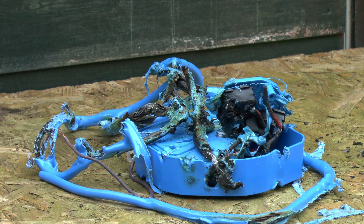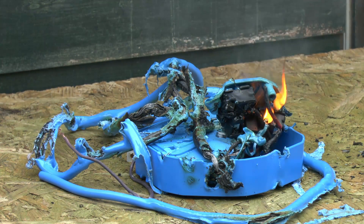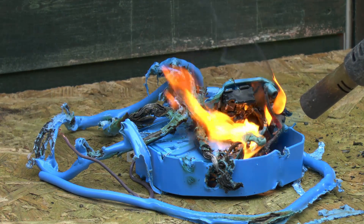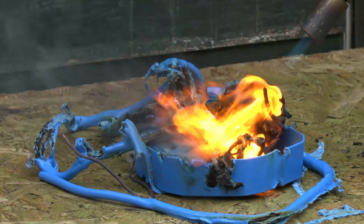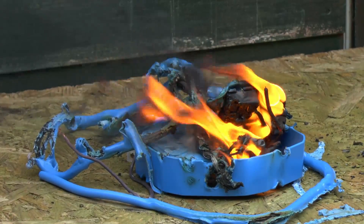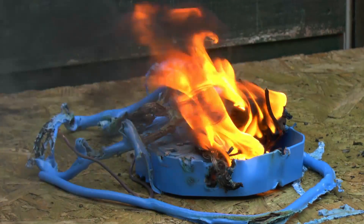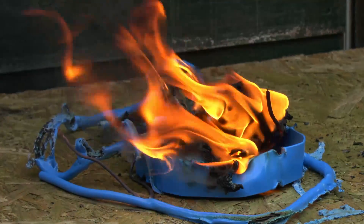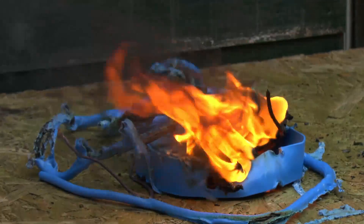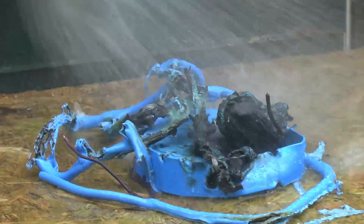The only remaining question is whether it's flame retardant in any way. The point with these things is that when they do set on fire, they should be self-extinguishing - once the ignition source is removed, the flame should die down. But as we see here, it's still burning after the flame was taken away. Let's apply a bit more flame over the whole surface. There's a nice fire going, with large amounts of black smoke pouring off. It's certainly not self-extinguishing - in fact it's getting far worse, the flames are spreading and increasing significantly. Pretty obviously this is not flame retardant in any sense of the word. If this did set on fire in your house, it would just burn your house to the ground. There are no flame-retardant chemicals in there whatsoever. We'll put that out with water - and that's the end of that smouldering wreckage.